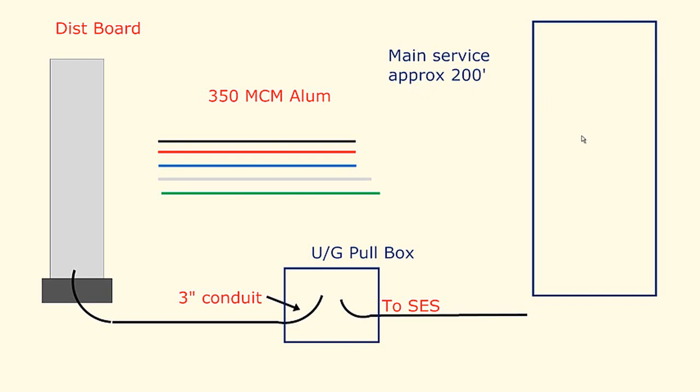What we're going to do is find the conduit — we'll get out a locator and then we'll have to dig it up, install an underground pull box, put in a couple 90s, and we'll have to cut this back to get enough wiring out of here to do an inline splice — a weatherproof inline splice. Then we'll install a new 90 onto this conduit going up into there and do the splicing there.